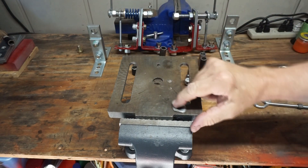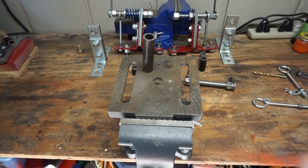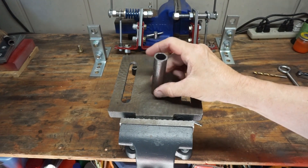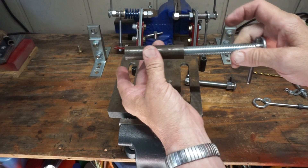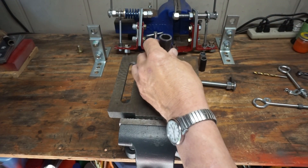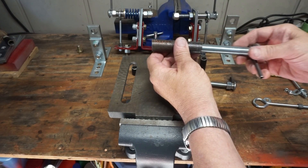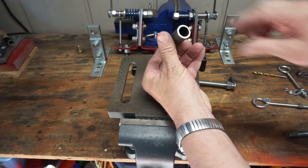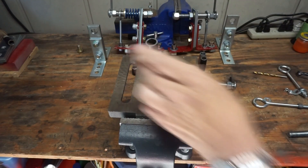We're moving down to some of our last components. You're going to need to take a section of regular black plumber's pipe — what they call half-inch nipple pipe. Nothing special; you can get it at any hardware store. A half-inch nipple pipe has a 5/8-inch inside diameter most of the time. Most of the pipe you buy is going to have a seam running down the inside that needs to be removed. You can take the rotary file we showed earlier, or a regular rat-tail file, put it in a vise, and ream that out a little bit.